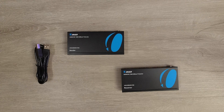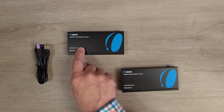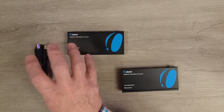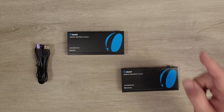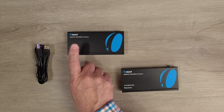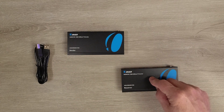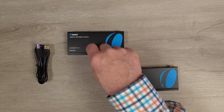With this particular HDMI extender kit, you'll find a sender unit and a receiver unit. The sender unit is at the primary location — wherever the PC is located today — and the receiver unit is located wherever you'd like to use that PC remotely. So this would typically be in your office, and the receiver may be in your den. The connection between these is a single LAN cable, typically a CAT-6 or CAT-7.